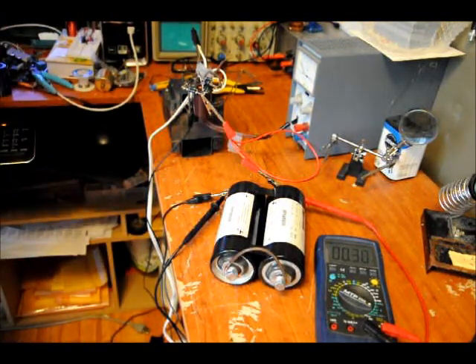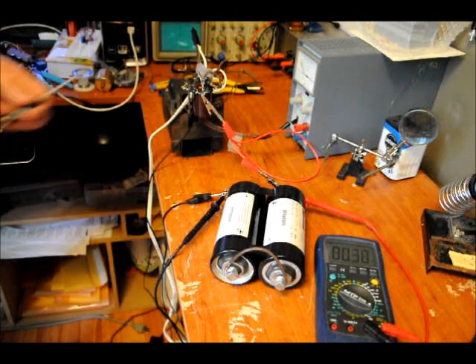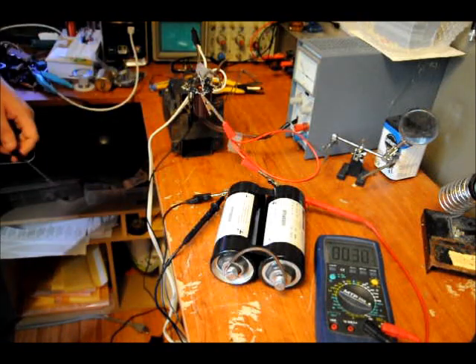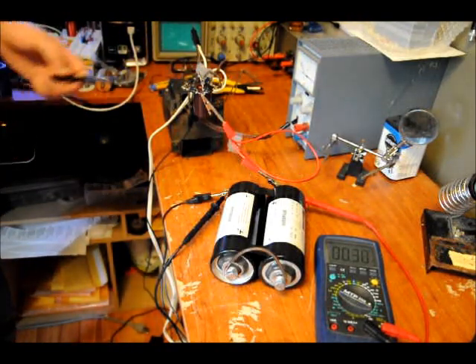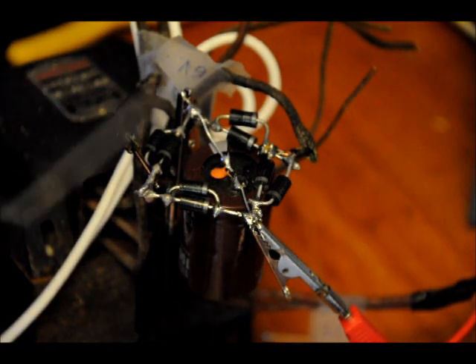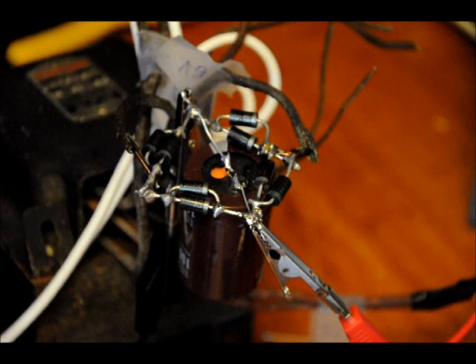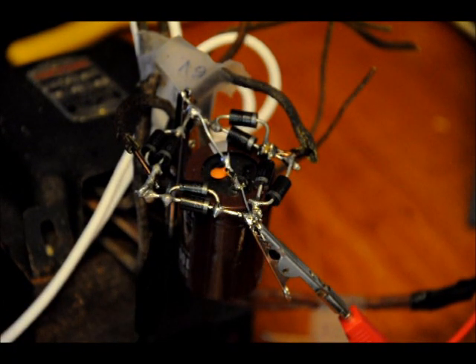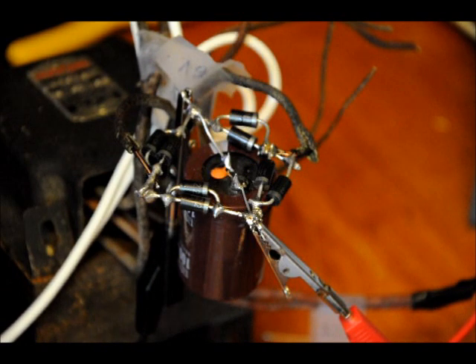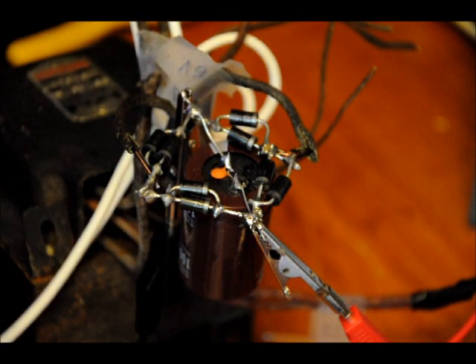This is going to take a long time to charge. What I've got here is my beastly transformer, and one of the outputs — AC — is 6 volts. I've got a huge rectifier with eight diodes in my bridge, four sets of two in parallel, and just a smoothing capacitor, which isn't really needed because we're placing it on a capacitor bank anyway. There's also a tiny decoupler in there. It should output 6 volts at about 3 amps, but I'm thinking it'll actually be outputting a heck of a lot more than that.